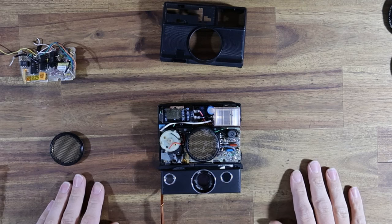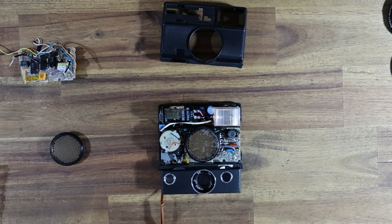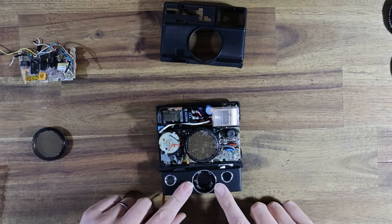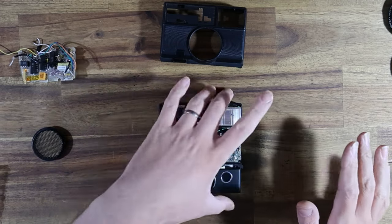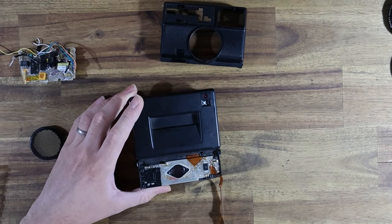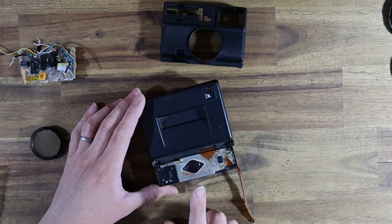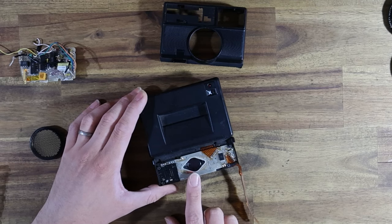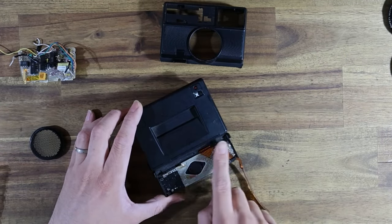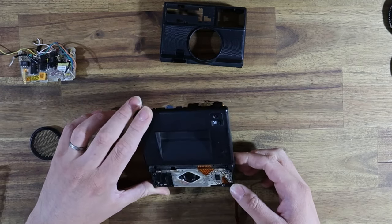It is the next day. I have completely stripped down that SLR 680 body. We're going to focus on the shutter and attempt to rectify everything wrong with it. I've confirmed that the shutter itself does work, which tells me the PCB at the back is in functional condition. This particular PCB certainly has some signs of being repaired in the past — I'd say this camera was sent back to the factory at some stage. When I took the bellows off, I discovered that the rivets holding the lens board on had been replaced. The PCB has clearly been resoldered before — this is not factory solder but repairman solder. Not the best soldering job, but certainly not the worst.